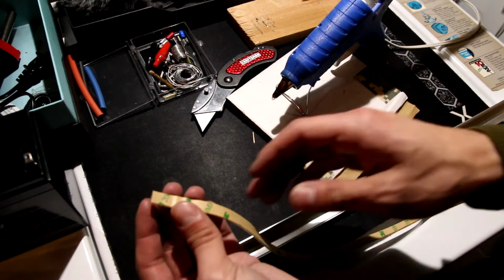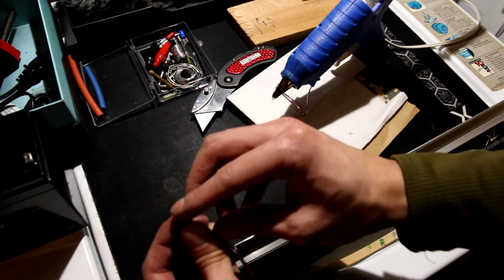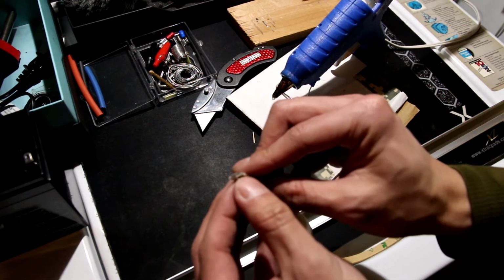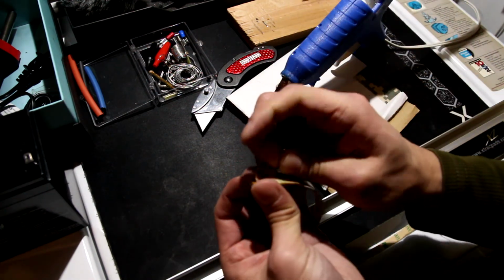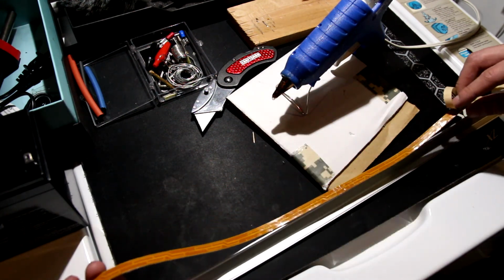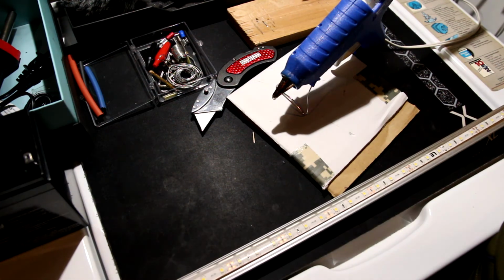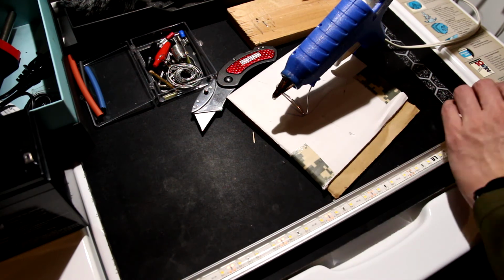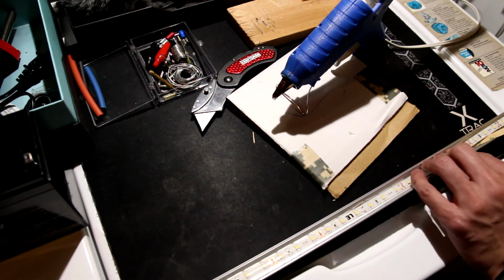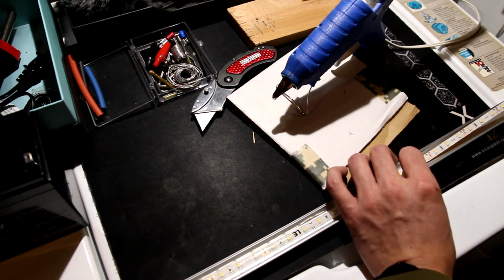On the back, there's that 3M strip tape, double stick tape. After a year of hard use, cold, ice fishing, it will fail on you, guaranteed. So just peel as best as possible. It will reveal the adhesive. I suggest not pulling it all the way; leave some so you can tape that corner down, and then just start pressing it down. And then you can start removing the other strip.